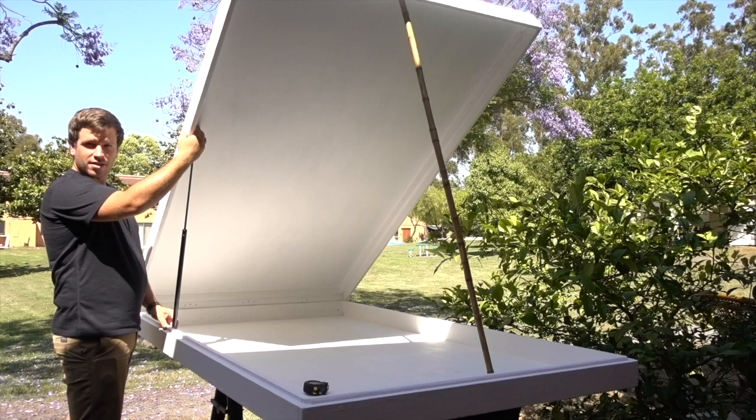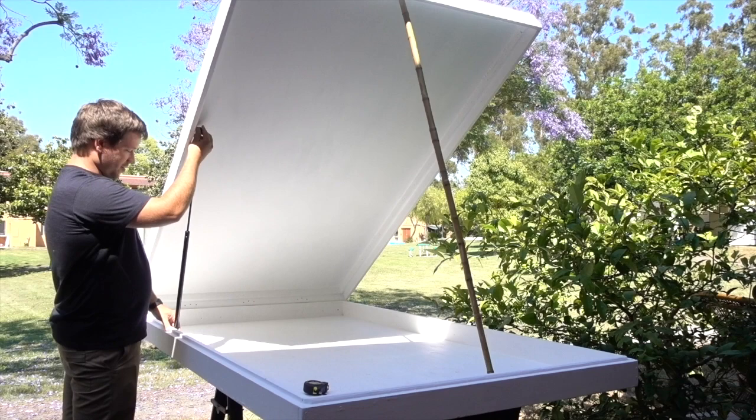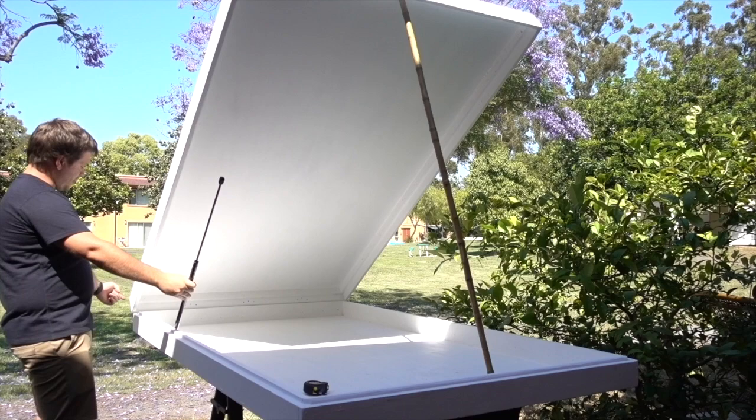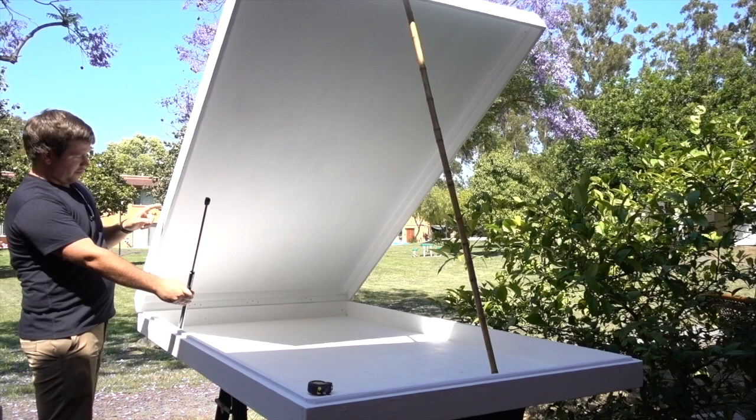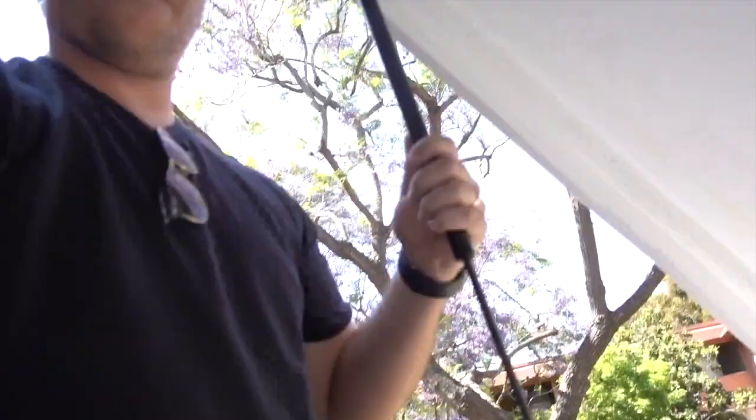Wherever I connect here has to drop down to be 19 inches away from the base point. So you have to kind of find the right angle. I don't know if this is valid. If I figure out where I place it here, then I can measure in from there, and that's the same distance from here. And then this top piece has to be 19 and a half inches from the corresponding location on the top. After a little bit of trial and error, I think I figured it out. For me, it's 33 inches from the end. It's gonna be about here. Boom, boom.